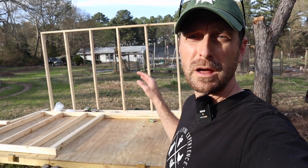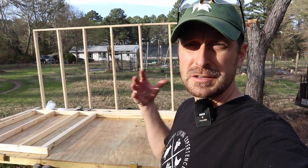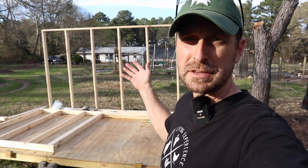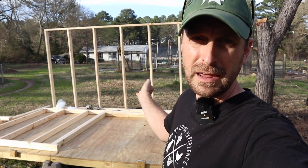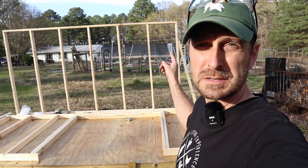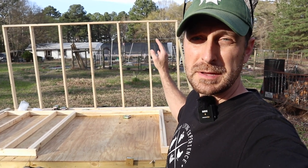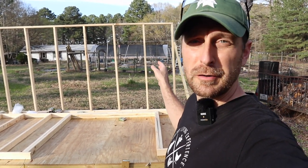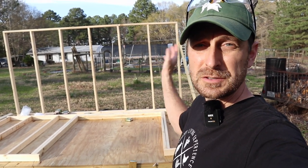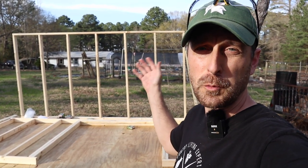Things are coming together well. I'm going to do the front wall before the end walls because that's just the way they designed it. Some framers frame from wall to a corner, from a corner to the next corner. But this one is the front and the back first, and then the end walls go in between those. I will get the end wall up tonight and connect it, because you can see the back wall there is racking a little bit. It should be stable enough for me to build the end wall and get it attached, which will stop it from racking overnight. You can also choose to put a piece of siding on the wall to prevent it from racking.